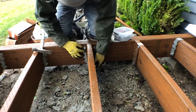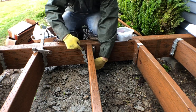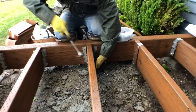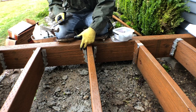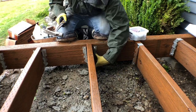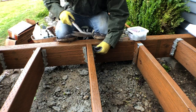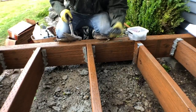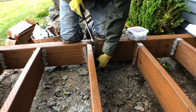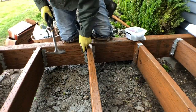The reason you need 16D on these is for it to penetrate the joist and the beam or rim board. So let me do a little demo for you. We have these little pieces sticking out — the reason they're there is because when you're off the ground, you want to just put the hanger up without holding it with your hand while nailing. So you just bend these in and then you can pop your nails in.